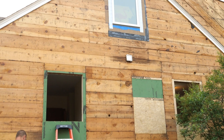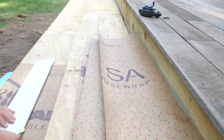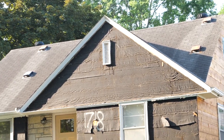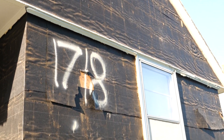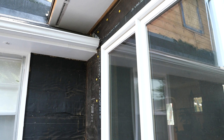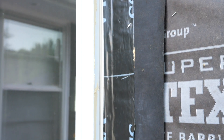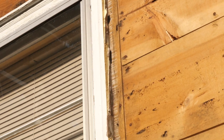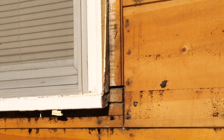Because sequences of construction are not always ideal in remodeling, we installed some of the windows before installing the HydroGap SA weather-resistive barrier. That SA stands for self-adhered, and that means the WRB is also great at being an air barrier. This cute mid-century home is in pretty decent shape, but after 70 years it's time we gave this WRB an upgrade. We're going to be replacing a lot of the cladding on the house, leaving some of the old stone, and on the addition that is about 10 years old, we're going to leave the felt and the windows in place because they're in good shape.